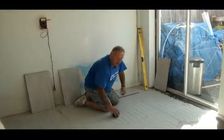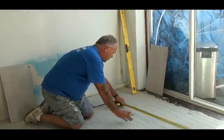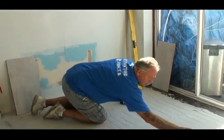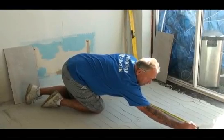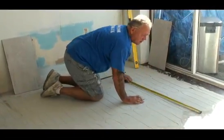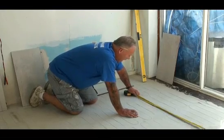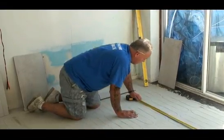See our floor tiling video for more on that. We can mark three units along this line — it doesn't matter if they're centimetres, millimetres, feet, yards, or metres; the bigger the better if you've got the room. That's three feet here. This method is called the three-four-five method, taken straight from Pythagoras's theorem, and it shows you how to set out a perfect square. That's three units along our main line.